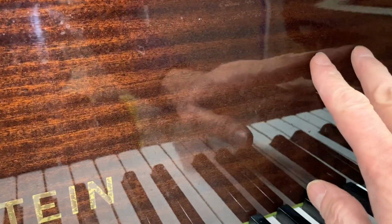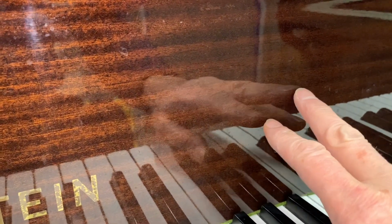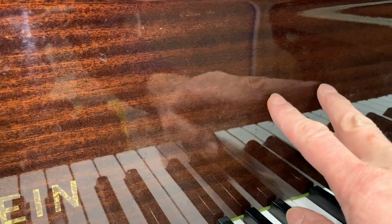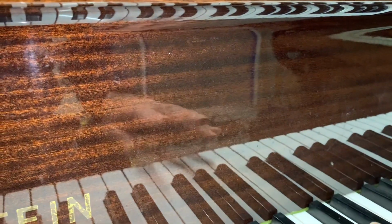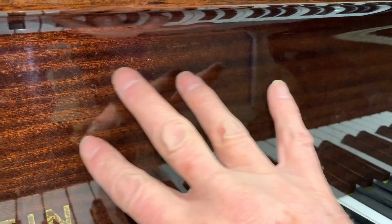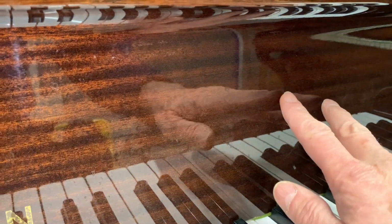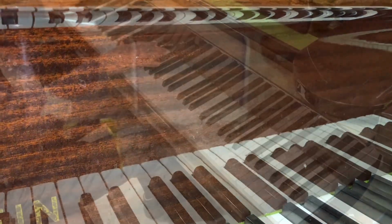Just wanted to add for clarity that if the polyester is taken off, this is a sort of two-pack plastic finish, then the problem is it might have got into the grain too much to really do a good job French polishing it, and in case it needs re-veneering, we can obviously choose what veneer you put on the piano too. So this is a very tasteful mahogany, and it'll come out slightly more contrasting and won't be so reflective, obviously, if it's French polished, and that will make it, I think, more pleasant to look at anyway.